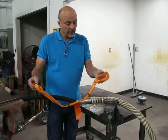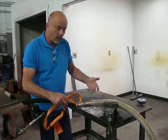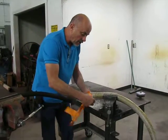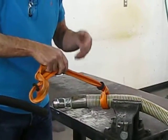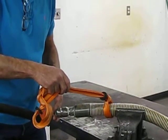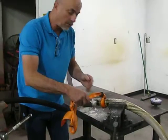The nylon chokers are designed to have a slip knot on each end and they are designed to install on a hose like this where you can slide it on, you choke it up, and you run your snubber down. But the problem with that is if you have a hydraulic system with several hundred gallons in it and you do not want to break connection and drain all your fluid. I am going to show you how to install this choker so that you do not have to break connection.